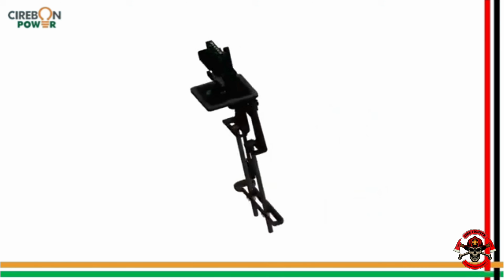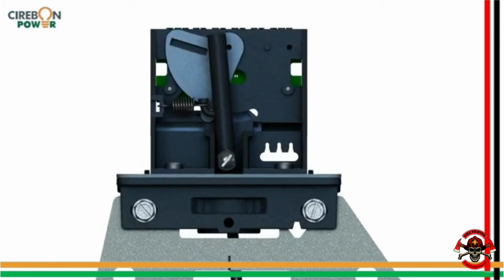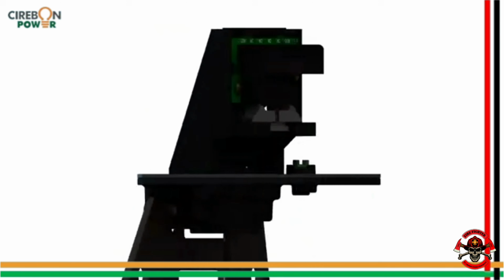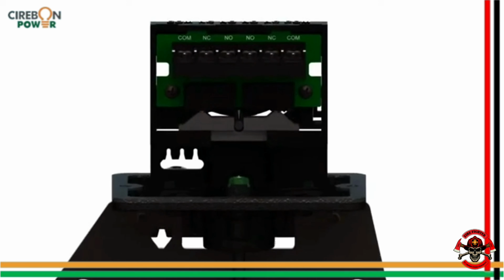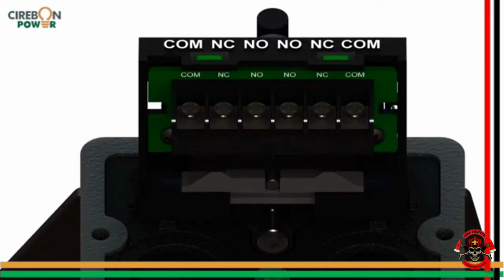There are three visual indicators on the OSYSU to help with the installation. When the device is in the normal position, the white mark will be visible through the window. The trip lever will be lined up with the mark on the mounting bracket. And finally, the switch buttons will be depressed by the switch actuator. An ohm meter, or continuity tester, should always be used to confirm the installation. The switches are marked for a normal, valve-open condition.